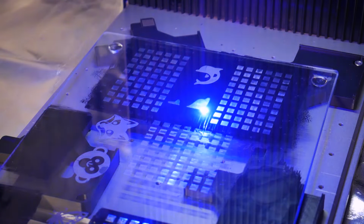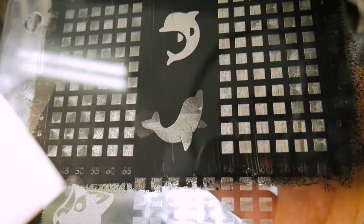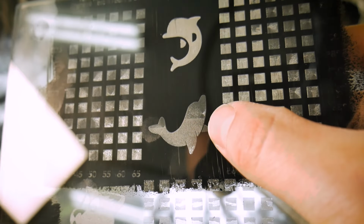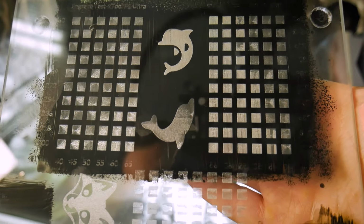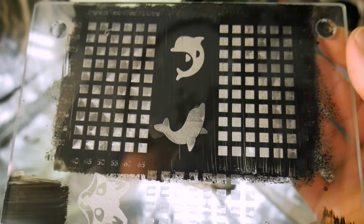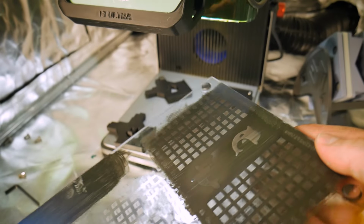If you recall, just a few moments ago with the laser marking paper and the Pentel chalk marker, I was using 50% power, 250 millimeters per second at a slightly higher lines per centimeter, around 140. And so despite these being similar black coatings, I'm finding that the power and speed settings need to be adjusted a little bit for the tempera paint.